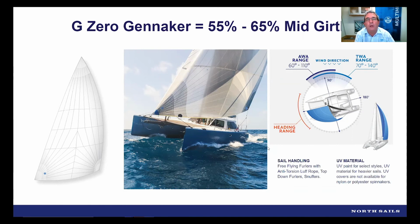As far as the luff tension goes, if you're talking about floating the tack of the G1 for better sail shape, you could do that in the way you're talking by loosening the line or loosening the halyard, but you'd absolutely have to retighten it to furl. That might be an extra step. Most of the time, I think you would just take the line that connects the tack of the sail to the furler, find your happy medium, consistent spot where you'd like to leave it, and leave it there. And then maybe if you knew you were going to be beam reaching for a day, it'd be worth a trip forward to adjust it.